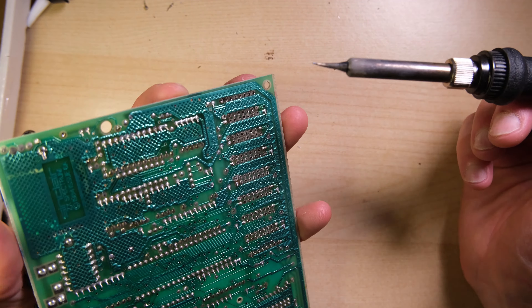I plugged in a spare ULA, which isn't appropriate for this board because of its age, but it did produce a video output — so yes, that original ULA is kaput. This board is a write-off, but I'm going to keep going ahead with repairing it because I can't help myself. The video output was there but completely unusable, so there's another problem in the video circuit. When I scoped pin 17 of the LM chip — the colour chip — it should be oscillating like a clock, but it was just stuck at plus 6 volts, so I'm pretty sure that the LM chip is kaput too.